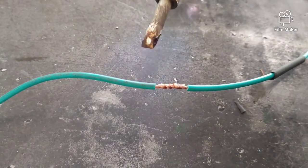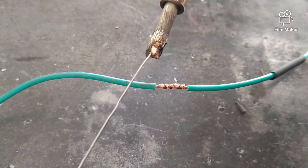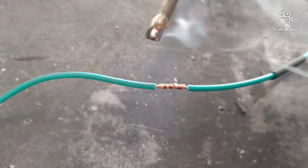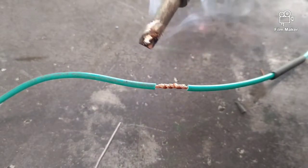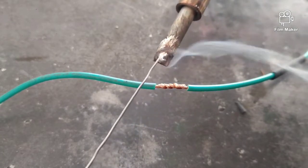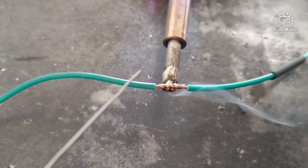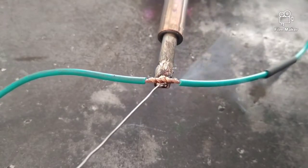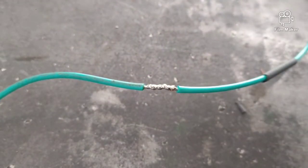You want the wire in a spot where you can easily solder it with the iron and the solder. Here's the trick: oftentimes I see people just trying to tap the wire with the iron and no solder on the tip, and they're having a hard time getting it to solder. What you want to do is get a nice big juicy pile of hot solder on the tip, then just hold it right there against the wire. You can see how it just melts right in. And that's good — the connection is complete.